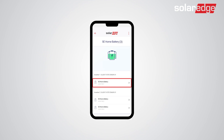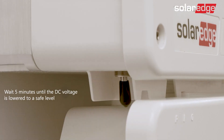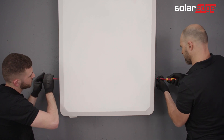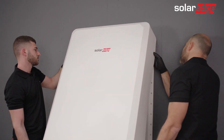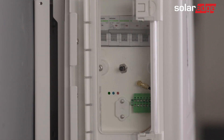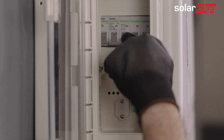We move on to physically removing the battery. First, turn off the inverter using the on-off P-switch. Turn off the inverter switch and turn off the inverter AC switch. Remove the battery cover by loosening the two screws attaching the cover to the battery enclosure and unsnap the battery from the top and bottom snaps. Open the inner transparent door and turn off the battery on-off P-switch. Now, turn off the battery circuit breaker.